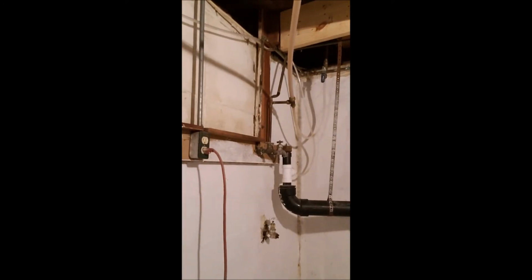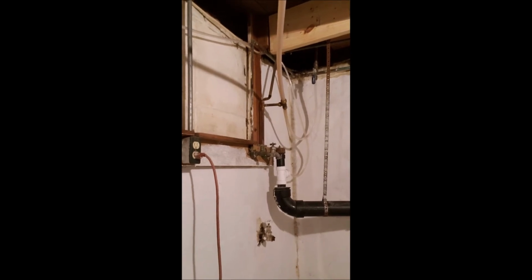And basically after that's done, I seal the floor joist and subfloor, I'll let that dry and do the second coat on the walls and the basement floor. After that, it's pretty much done. I've got a few other little projects they're probably going to want me to do after this, but that will conclude the sealing and mold remediation of the basement. And as you can see here, how nasty that was prior to me cleaning and doing the sealing of the block.